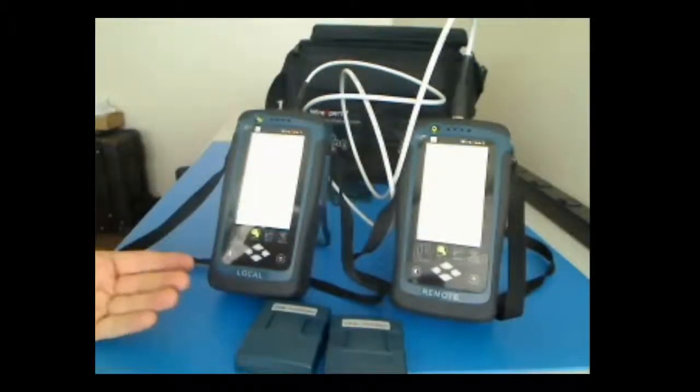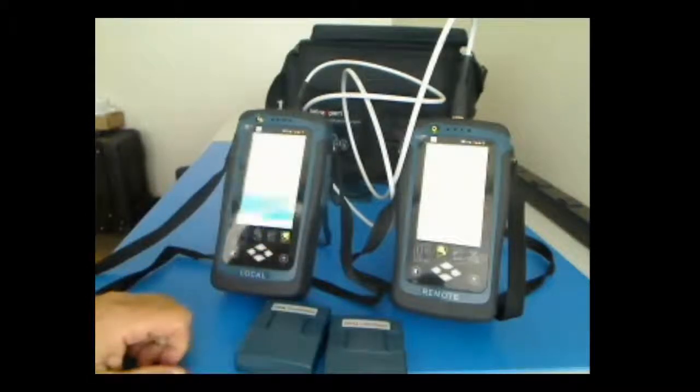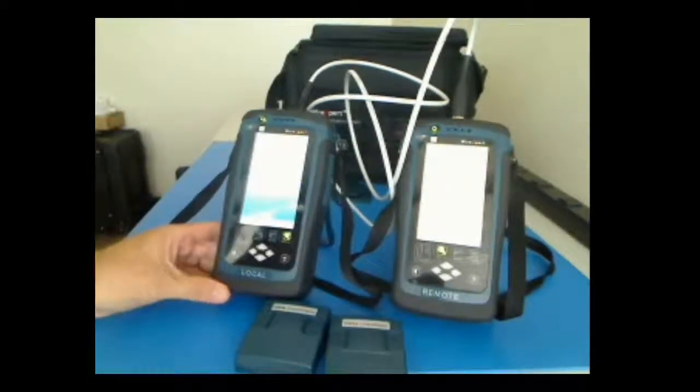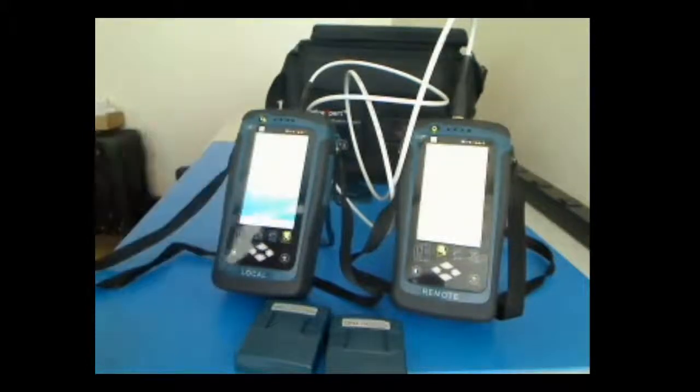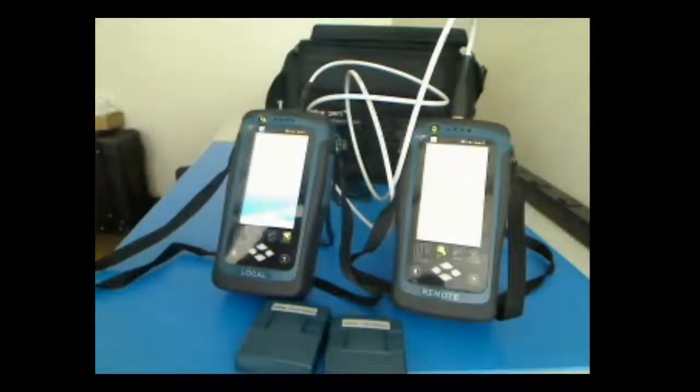This is where we'll do the permanent link test. What we're going to do is go to the Tools menu. Again, you won't be able to see this on the screen — I'll walk through it in a little more detail. From the Tools menu, there's a choice to do Set Reference. When you run it, it will tell you if it was successful — it's checking all the connectors, the cables, the cards — and then you're ready to do your permanent link test.